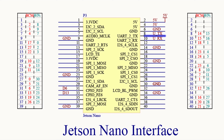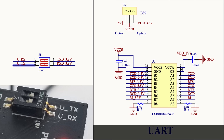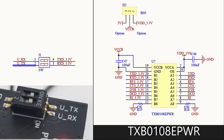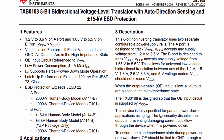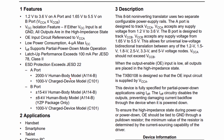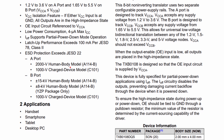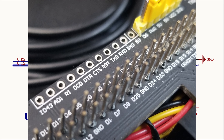The two UART lines don't directly connect to the SIMCOM 7600. Instead, they pass through a pair of switches and an integrated circuit which, according to the datasheet, is a level shifter. This circuit allows the SIMCOM 7600, which uses 1.8-volt signaling, to communicate with the Jetson Nano, which uses 3.3-volt signaling. The two switches allow the SIMCOM 7600 UART and the Jetson's UART to be disconnected from each other. It is also possible to connect directly to the 3.3-volt side of this integrated circuit through some pins exposed on the board.